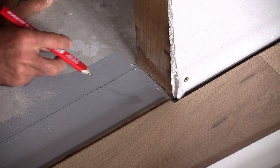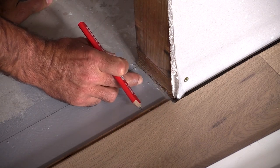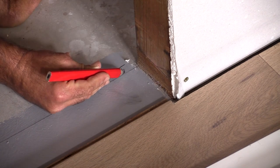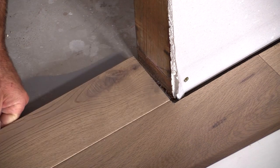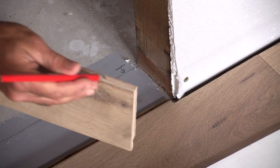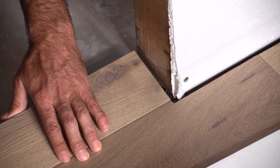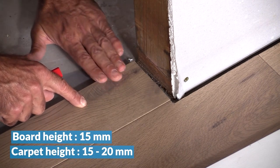The position where you want to finish this board - you can see the line marked halfway under our door. You want to identify which side of the jamb the door is going on. For us the door is flush with the internal wall and opening into the bedroom - the door is 30mm thick, so we're coming back basically 15mm from the edge of the gyprock, which lands the board halfway under the door. That way you've got carpet finishing halfway under the door and floorboards finishing halfway under the door. Because there's about 4 or 5mm of veneer on this edge, just get a little tool or sandpaper and chamfer the edge so it has a nice pencil round - no splintering edges - and the carpet guys can run their smooth edge along and turn the carpet down for a nice joint.